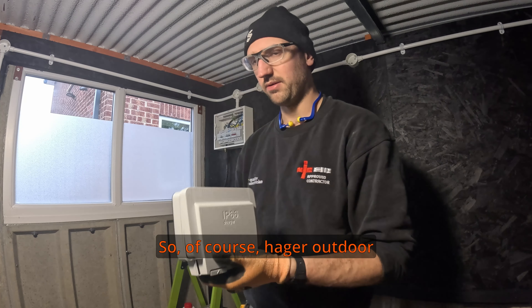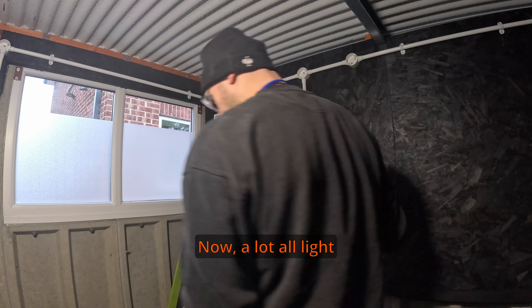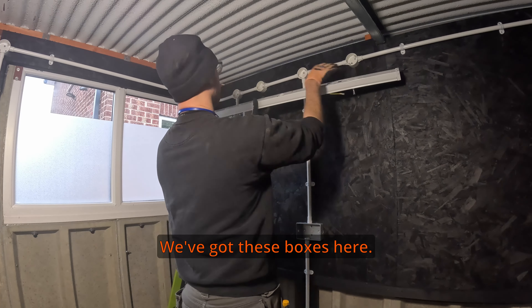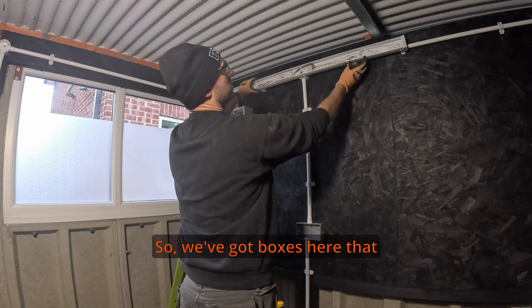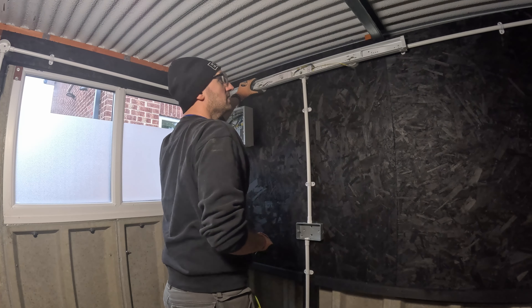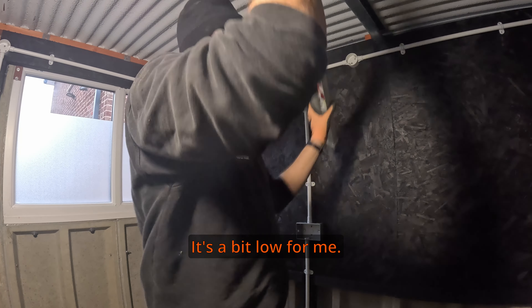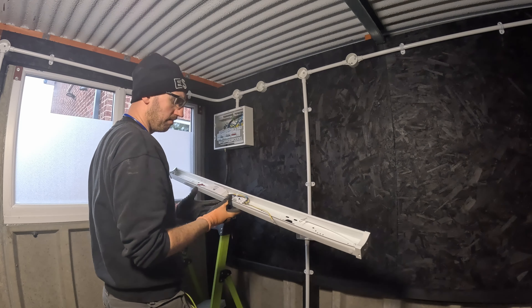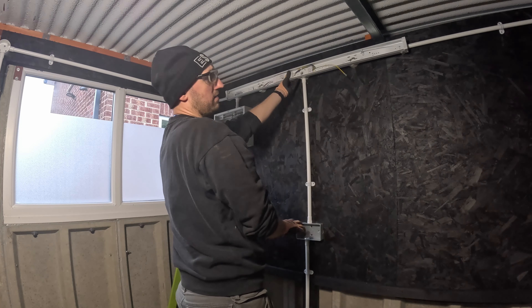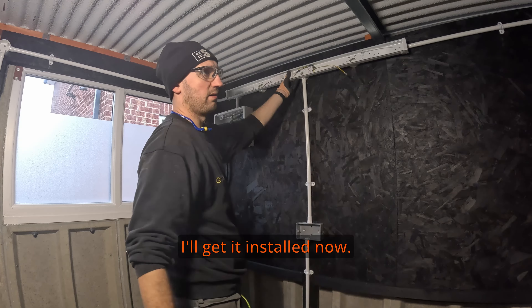Of course a Hager outdoor double socket. Now all light fittings come with this setup, so I've measured that. We've got the back boxes - there's a lot of boxes but this is why - we've got boxes here that perfectly mount onto there and then you'll have your light coming out that way. I don't want to fix the steels here because they are a bit low for me - when they're out of the way like this you're not going to knock them. I've also mounted them so we haven't got other circuits flowing through this lighting circuit, which is a big no-no.